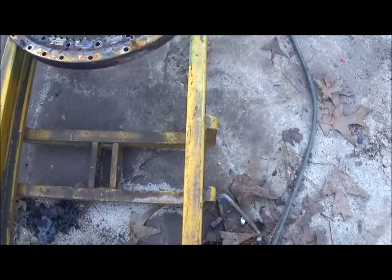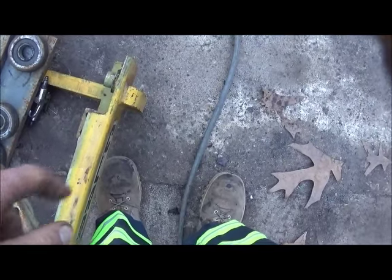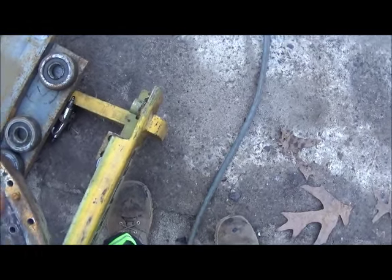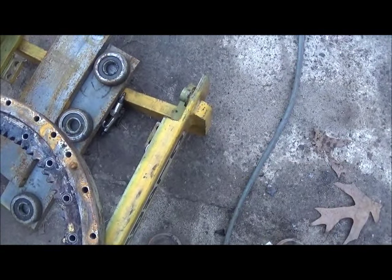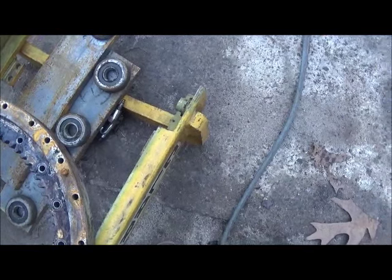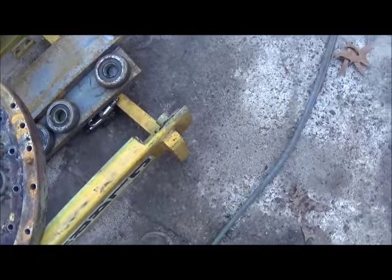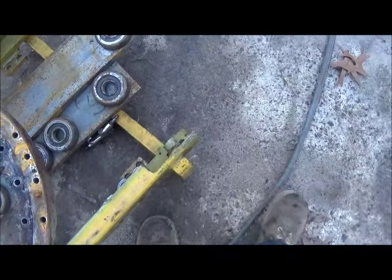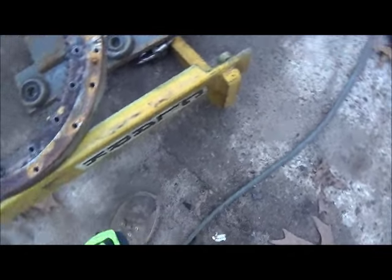That will leave me running to the front side and putting one crossmember in, because this rail is only 68 inches. Our subframe is going to be just a little bit under 120 inches. We may add two crossmembers up toward the front, but this carriage will sort of serve as our crossmembers and help support the subframe. There'll also have to be a plate across the back that bolts on to be able to get my rails or my trolley in and out.